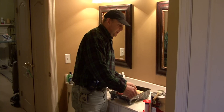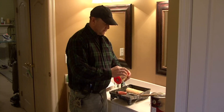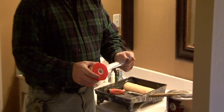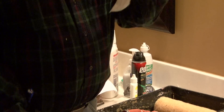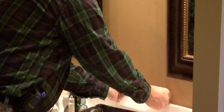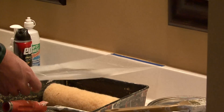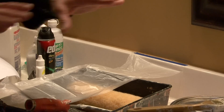The next thing you'll need is a good paint brush for cutting in around the edges and corners. And then you'll need some painter's plastic and some tape. One thing that's handy is that you can get these paint masks that have masking tape and plastic all in one. I'll just rip off a small piece to demonstrate. You take this and around all the areas that you're going to paint, you just mask this on and then pull your plastic out so you can cover your countertops, put it around the base molding, and cover up the floor.